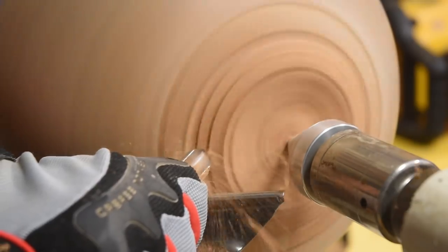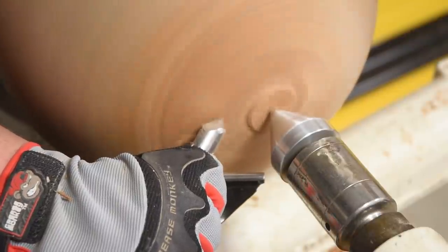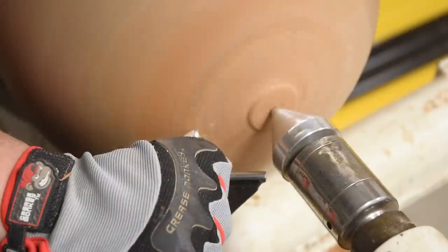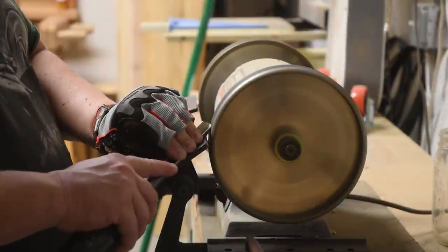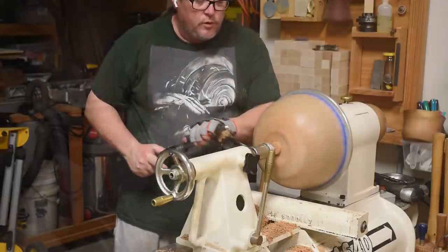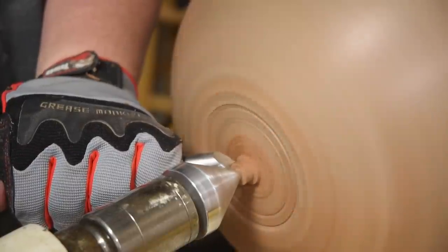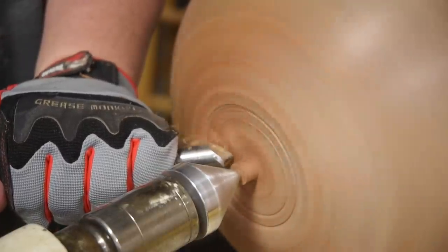So when I do a base on my upper end ones, I will make it completely round, and then I will cut in the foot where I want it. That's generally a feature of how deep I went with the bowl and the shape. This one right here, I wanted the foot to be about a quarter of the diameter because I thought that would look right. It would sit right. And the sides of the bowls are really, really thin, but in that same graduated remark, the way they curve on the outside, the bottom is probably 3/4 of an inch. So there's a bottom weight bias with that bowl that I think has a cool feel to it.